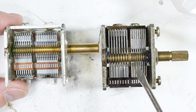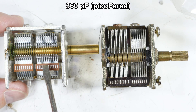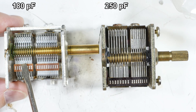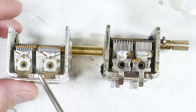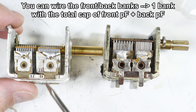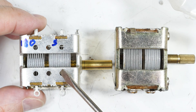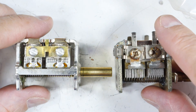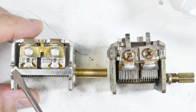Here are two two-bank capacitors that are very similar but different sizes. This one is 360 picofarads in the front bank and this is also 360 in the front bank. The back bank on this one I've measured at about 250, and the back bank on this one is 180, so there are some value differences. Rotating them around: the leads on this one go down - typically used to mount into a board - while these go sideways, a little different. On the bottom this one has holes but they're not tapped, and this one has no holes.